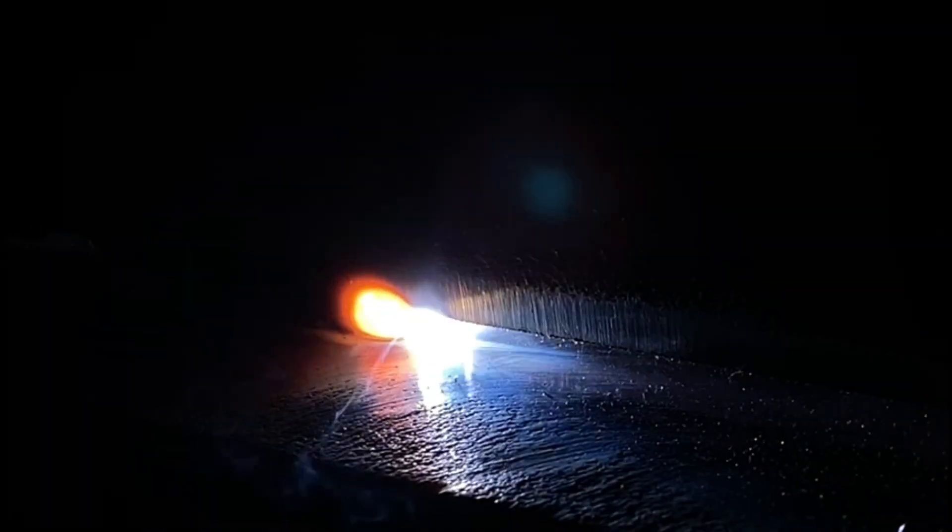We're using a dip technique. As you can see from this shot, we're penetrating through and fusing to the bottom plate and that top edge, creating reinforcement so that it's not under-flush from our top plate.